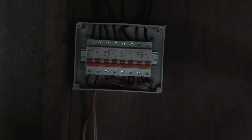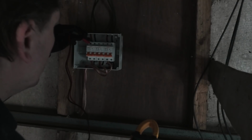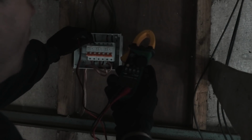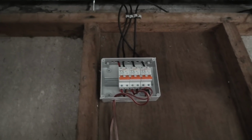From the circuits. Okay, I couldn't get that to add up, so I tested a bit more and sure enough, I had messed up. Yeah, that happens. So right now, open circuit on the first row of solar panels, we have 142.9 volts coming in. Awesome. Let's move on to the next pair of panels. It's never as simple as you think it's gonna be.